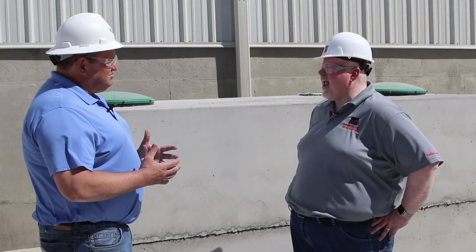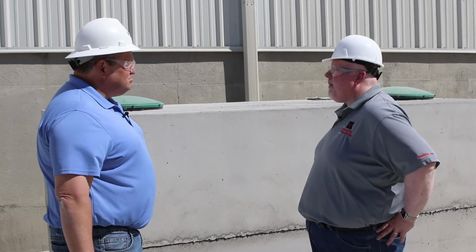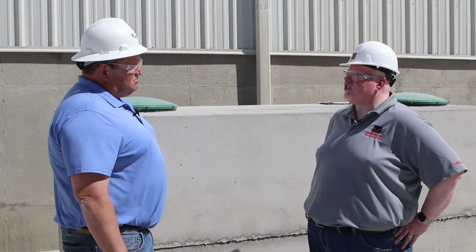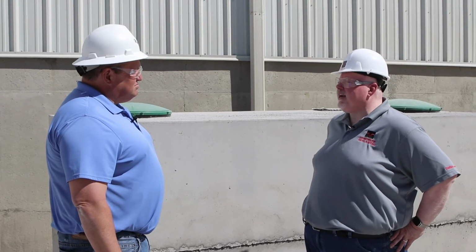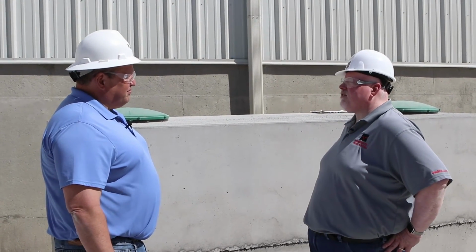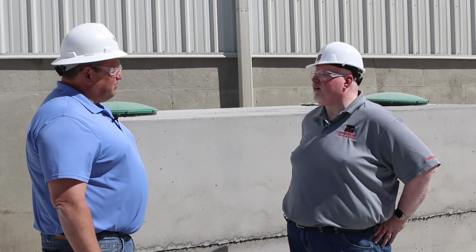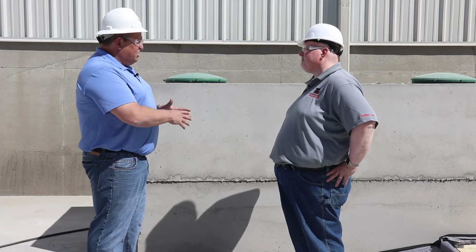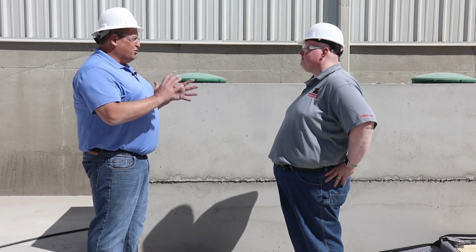Well, Claude, if the tank cannot hold a vacuum at all, regardless of the repairs you've made, obviously that tank does not pass the test. It should not be repaired. But also if the tank has a structural crack or some other major failure, that is also a reason that the tank should not be allowed to pass this test or be repaired for a test. So at that point, the tank should be disassembled, marked as failed, and then start with another tank.